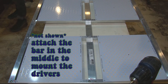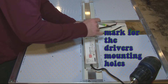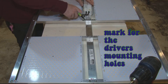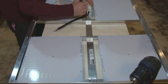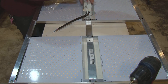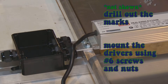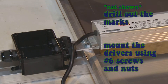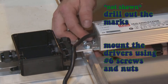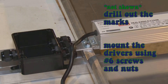I must not have recorded putting the flat bar on the fixture, but it's quarter-inch screws and nuts — easy to imagine. I take one driver and go through all the fixtures, marking on the flat bar where I'll drill to mount the drivers. I then use number six screws and nuts to mount the drivers to the aluminum bar on the top side. You can mount the drivers to the bottom for a low profile fixture, but I didn't like the idea of the weight of the drivers being held by just a nut and bolt.